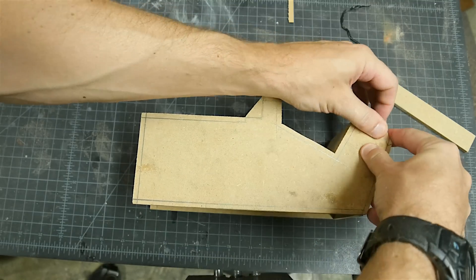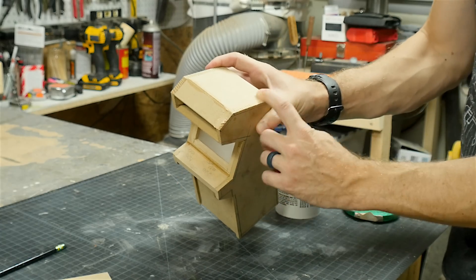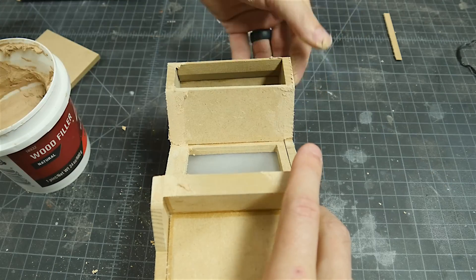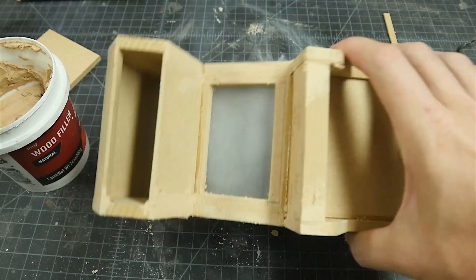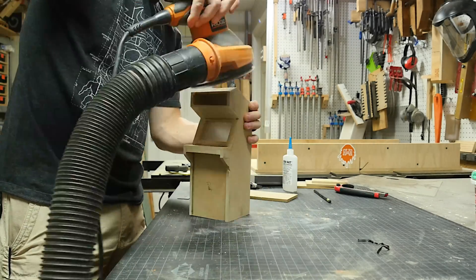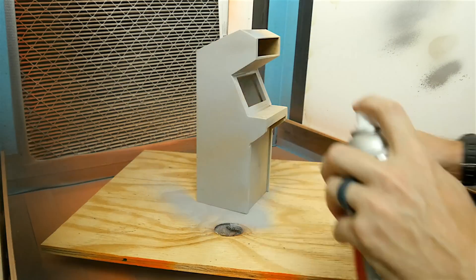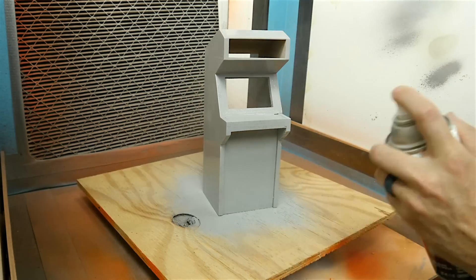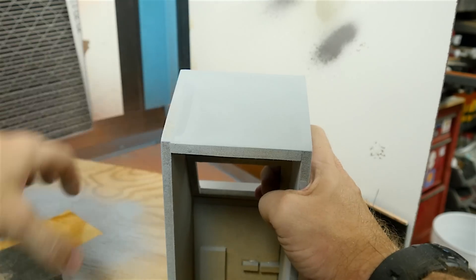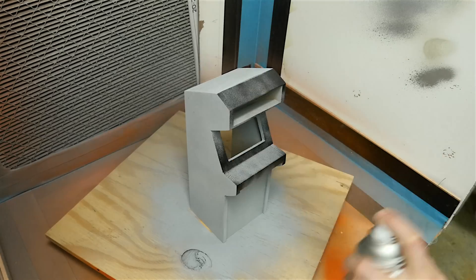I made sure all the panels lined up with the outside edges, but then essentially the construction was done. I used some wood filler to fill in any gaps in between the panels, and just to smooth over some of the joints between the different pieces of wood. This stuff was all kind of cut one piece at a time, so nothing is perfectly measured, nothing is perfectly lined up, and wood filler is a pretty good way around that. I sanded everything with an orbital sander on low speed so I didn't take off too much material, and then used a sanding block to finish it up. MDF soaks up paint like crazy, so before I went to paint, I did several coats of primer. The first coat seals it, but it also raises the surface a little bit, so you definitely need to give a good sand before adding a second coat and possibly even a third. I only did two, and it ended up to be a nice smooth finish.